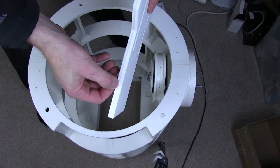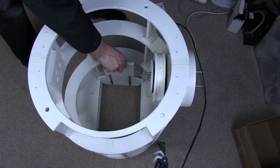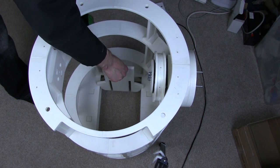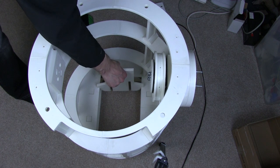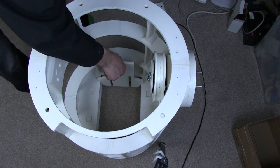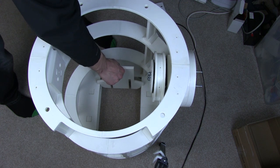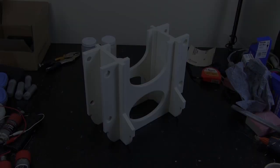The first one is printed - I stuck the two 5mm sections back to back to make one of the ends. Those slots are for the longer pieces to go in and it should fit all the way down here and fit perfectly in there - which it does, so that's quite good. As long as I can push this down into here, these pieces fit nicely into that slot, which means there'll be no wobble sideways. As long as I keep this pushed into the bottom, the center foot won't have any scope to move around because it'll be locked into the hole. I need to get the rest of these printed so we've got the whole box section, mounted on rails at the front and back of the frame for the wheels to run on. This should only need to push up and down and be held into the bottom, which takes quite a lot of the engineering challenge away from keeping it stable.